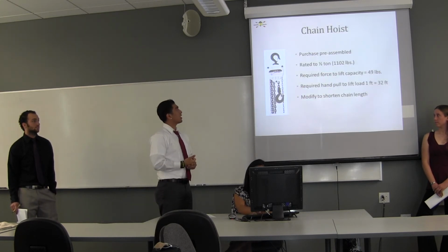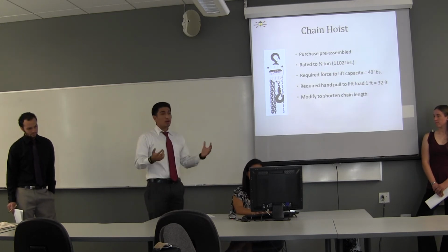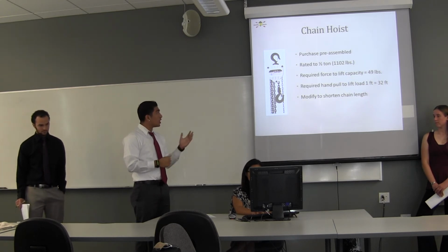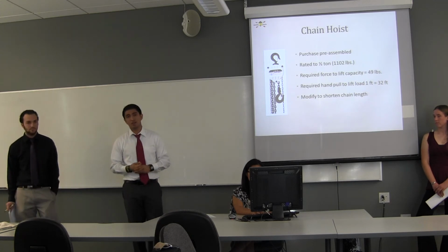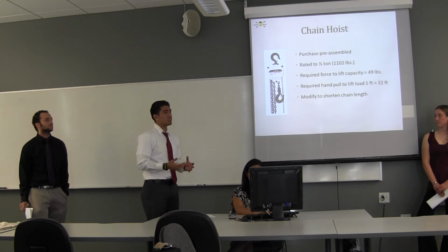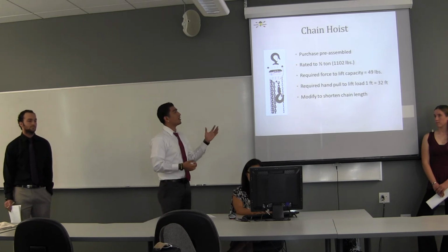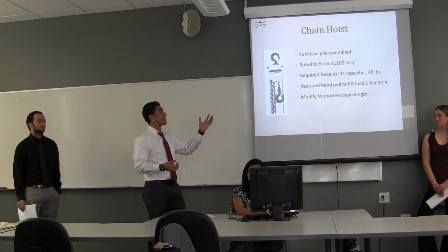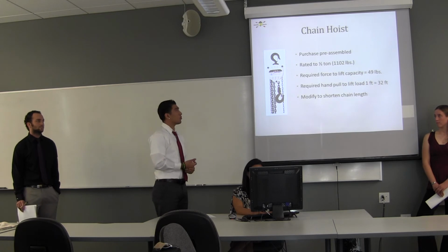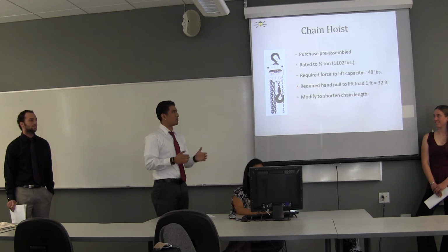Thank you. So on to the next component, which unfortunately you couldn't see in our SolidWorks model, was the chain hoist. Again, we were going to buy it pre-assembled. The one we're looking at specifically is rated to half a ton, which is about 1,100 pounds. The reason we chose the chain hoist was because of its great mechanical advantage. In this particular item, in order to lift the half ton, you only need 49 pounds. In reality, they're going to be lifting their own weight, which shouldn't be more than 500 pounds, so they should need about half of 49, or about 25 or so.